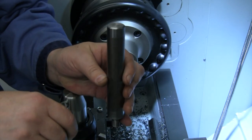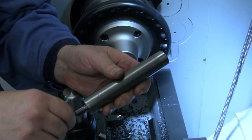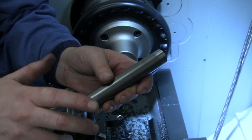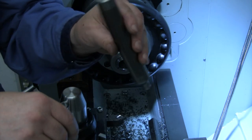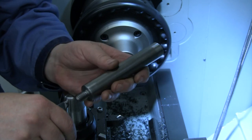Definitely more diameter than I'm sure that I need. I think 1/2 inch is plenty, but that's what's gonna fit nice, and that's the material I had handy since I had 1 inch. Why spin it down smaller? It gives it a nice shoulder to stand on that table. You'll see that here in just a minute when we go bolt it in place.